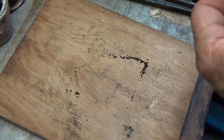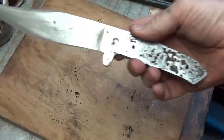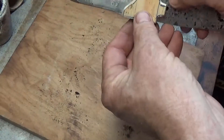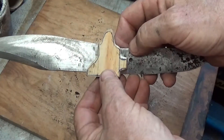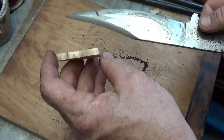What I want to do today is make a bolster for a bowie knife. This is the knife. I want to put a piece of brass in here as a guard. So what I did is I cut a piece of wood about the approximate shape of what I want this to be. I have angles in here called drafts. Since I'm going to do a sand casting of this, you can see the angle there.